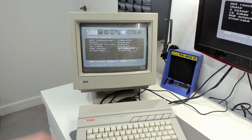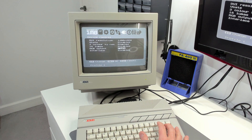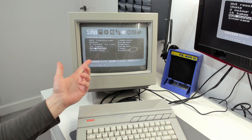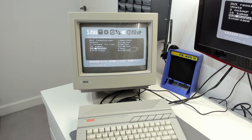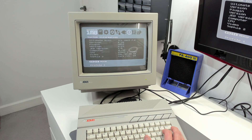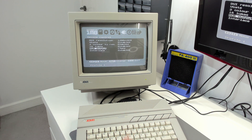What I accidentally found is that when I switched to C-Sync YPBPR — which I think is component video — it actually worked. What I discovered is that the C-Sync YPBPR item in the list was swapped with the RGB version, because the other version is RGB standard, RGB C-Sync. I remembered that was a bug and I was sure I'd fixed it. I couldn't understand why this version of the Sophia plugin still had this bug. After filming, I had a look at the source code for the plugin, and it turns out I had already fixed it — but I hadn't released the update yet. So all I had to do was compile the plugin, flash it to the machine, and it was fixed. That was the reason we had a green display.